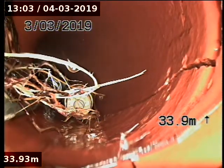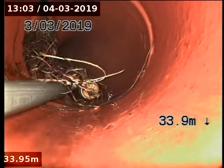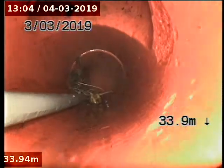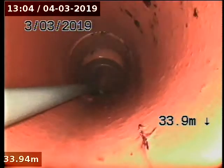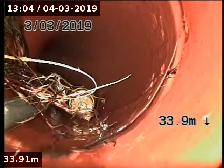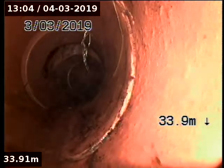This is the bend of the crack where the tree root is. It's as good as we're going to get it — they've been machining it for a bit. There's a big hole on the side of that drain. There's a large root growing right up here. There's a 20 IO inspection point just there. This is the only area where there is tree root, you can see. They can't push the camera any further down than that.